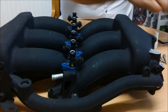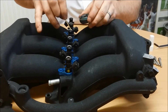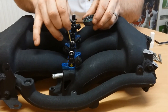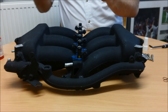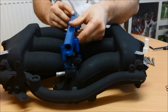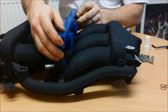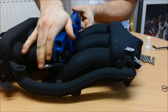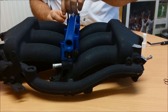At this stage, lubricate the upper o-rings and, making sure that you have this correctly aligned, place over the top of the fuel rail. It will go both ways round but it will not align in both directions, so make sure your bolt holes are lined up. You should then fairly firmly be able to push it down. Install your retaining bolts.